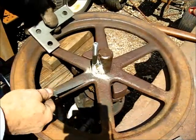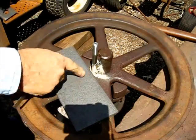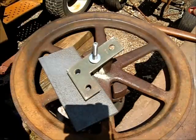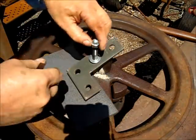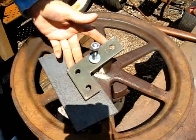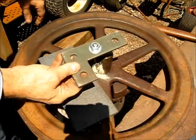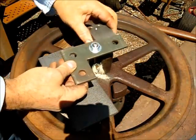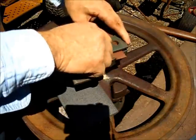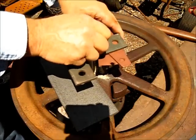I repositioned the flywheel to an upright position just to make it easy for positioning the metal. I want pretty good coverage right there, welded both sides. I put this on yonder and we made a key puller. I raised this out to the fours, then measured from there to there to see what distance I needed — three and a half on one side, one and three quarters on the other. To make this come out level, just stack some metal in. You want all of that as close to the pull bolt as possible.